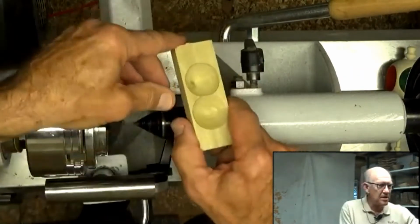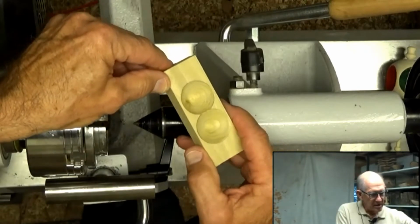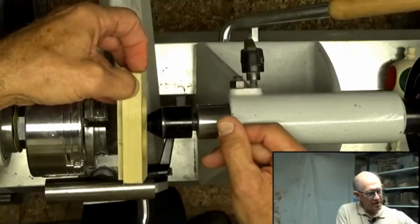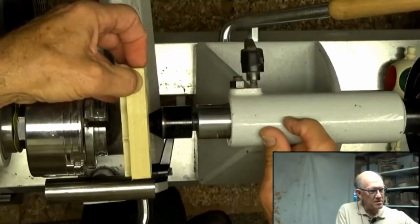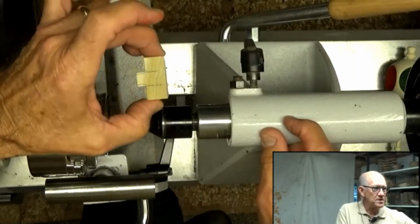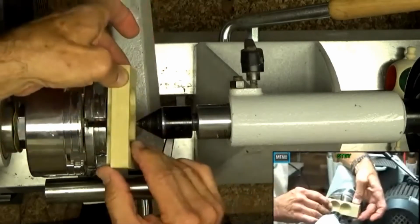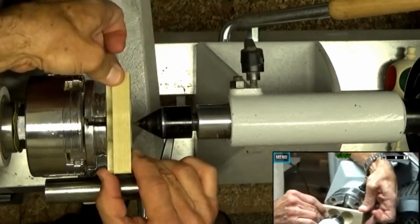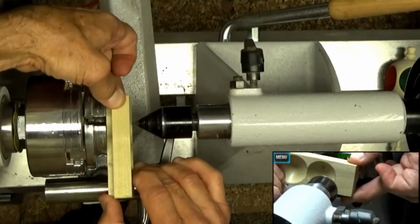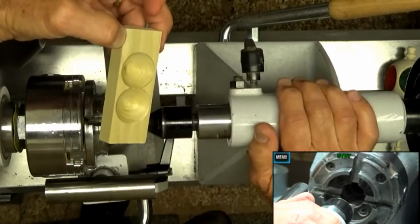The other is the cutting in on the face, which is a very different thing because the way things are spinning for this, it is cross grain there. And then coming in to cut these has a lot of potential for run back. I just cut a piece, knocked off the pieces out in the corner there, so I could put this into my chuck across there, off to one side or off to the other side, and could practice doing these before I got to the real McCoy.